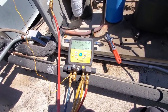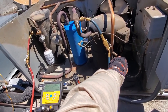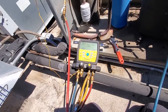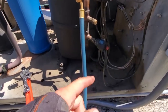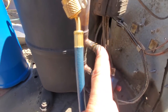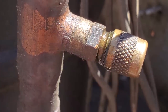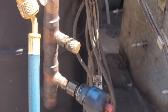My pressures are already pretty high — just standing pressures. It tripped the high pressure control again by the time I went downstairs. So these are my standing pressures; I'm going to reset it again. It won't even reset because it hasn't dropped low enough to cycle yet. As I'm looking at this, there's an oil leak somewhere right here — there's oil everywhere. I put some soap bubbles on the threads, and there are bubbles coming out of this cap right here where the Schrader's at. Tiny, tiny bubbles, but enough to be a nuisance leak. We'll make sure we fix that today too.